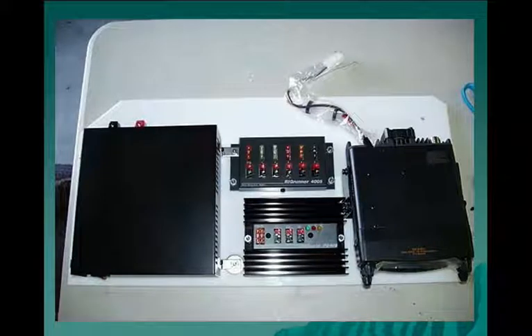Here again is a close-up of the equipment: the 23-amp power supply on the left, the super power gate, the Rig Runner distribution panel, and the FT-8800 on the right. Here is a close-up of the kit mounted on the metal perf. You can see the wing nuts quite visibly. And this one shows the wiring run to the radio, to the battery, and to the power supply.